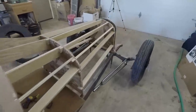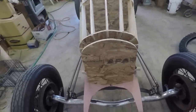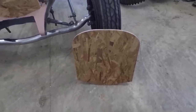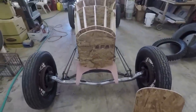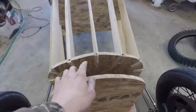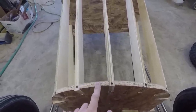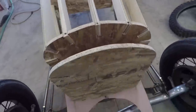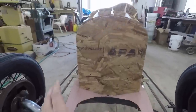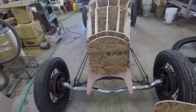One thing I did up here that you didn't see is originally this piece right here was what I had on the very front, and I didn't really like how square it looked. It's only 1 inch taller than it is wide, so that's basically a square. I wanted it to look a little bit more narrow and taller. So what I did was I cut out 1.5 inches from this piece, just right out of the middle, and brought that together. So this piece is 1.5 inches narrower than before. And then, I narrowed this piece by almost 2 inches and heightened it a little bit. So now this piece that's on the front there is almost 4 inches taller than it is wide, which gives it that more narrow look.